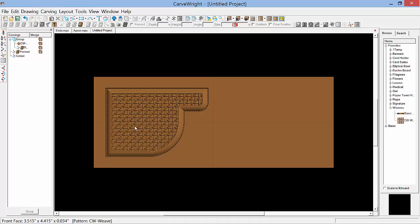In the next video, we're going to put the circle in for the paper towel bar that goes through, or the dowel. We'll also size and create the cutout going around the outside edge. We'll also create the rabbet on the back. We're going to create a rabbet on the back side of this edge right here to accommodate the back. When we cut the back, it's just a square board, so during assembly it'll fit into its own recessed area, and the back will be flush with the back edge of the end.